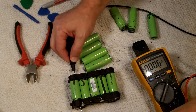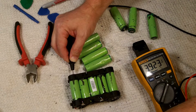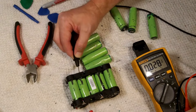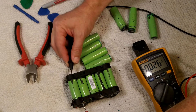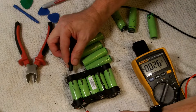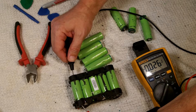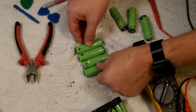I went ahead and checked each one of these cells individually for voltage. Each cell is about 3.9 volts, which is slightly overcharged, with the exception of one cell which is basically zero volts. That zero-volt cell is the bad one that caused the whole pack to stop working, because the BMS noticed it had zero or slightly negative voltage. But all of these cells look pretty bad overall. I've picked four of the cleanest-looking ones and I'm going to check their actual capacity right now.